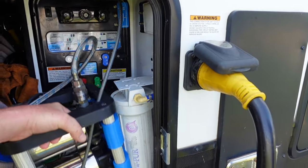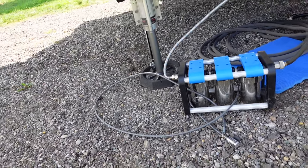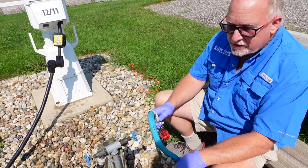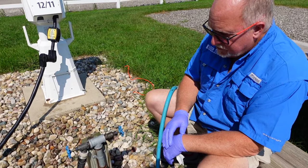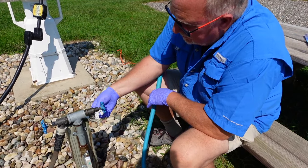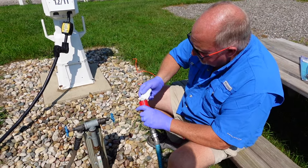I'm going to pull it out of the way. You can use it outside like that, which I've done — I lock it under one foot of the leveling system. But it works easier for me to have it sideways up here in the wet bay. You want to make sure you're using a sanitary hose, not the one you use for flushing your black tank. We've got a blue sanitary hose that we use for servicing water heaters and fresh water sanitation. Take a sanitizing wipe and make sure all the fittings are wiped down adequately — just an extra step to keep things nicely sanitized.